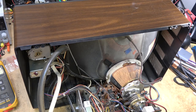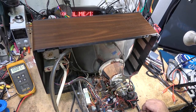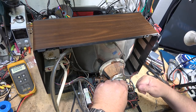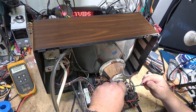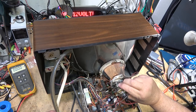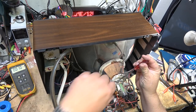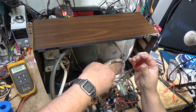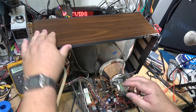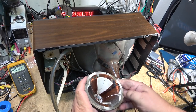Look at the smoke. Since the yoke is shot, I might as well show you where it's shorted and where it's burned. We'll take the yoke off — I think the yoke can come off this tube. We'll take off the convergence pack and release the clamp on the tube. I've got the yoke unplugged, and I should be able to just give this a turn and it should come right off. And there is the damage, right there.